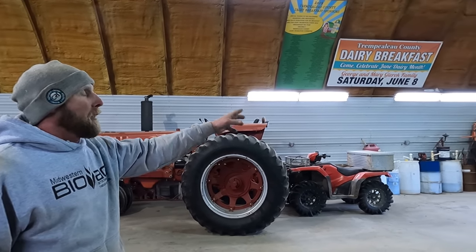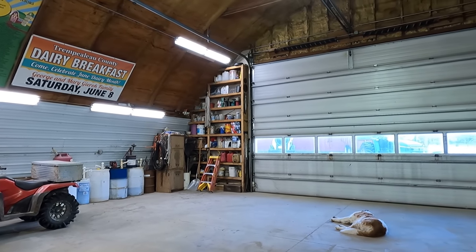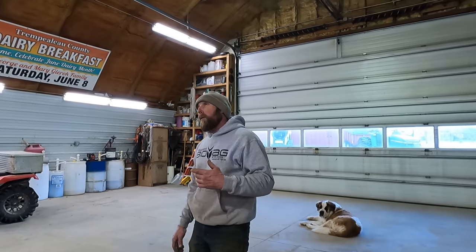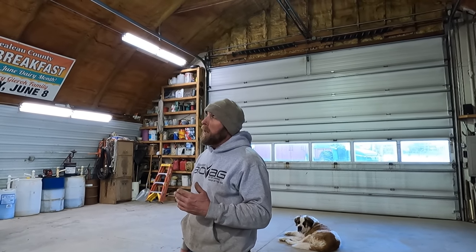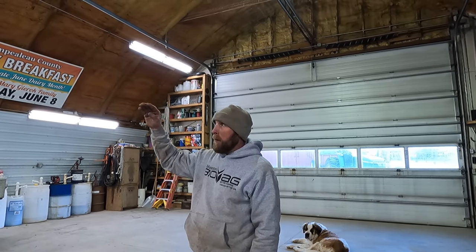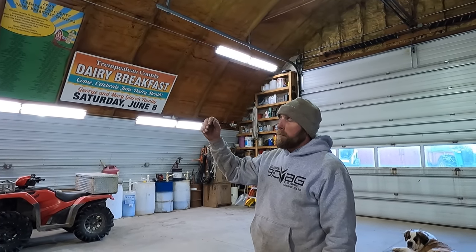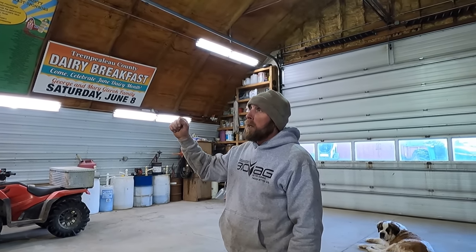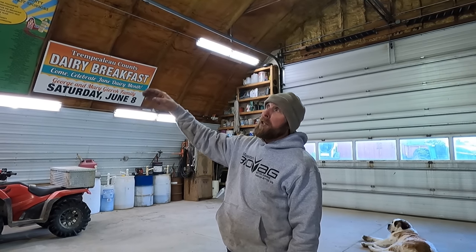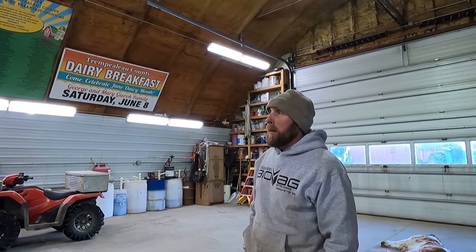And then the shelving, we only had those gables we could use for shelving, and maybe that's enough. So if we were to do it again, there's few changes I would make. I would either have more chords on our laminated rafter or put more rafters in to get it stronger, so we were able to run the steel all the way up to handle more weight.